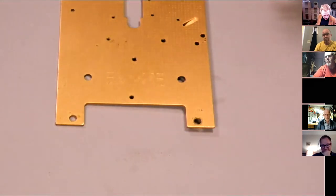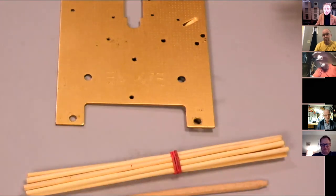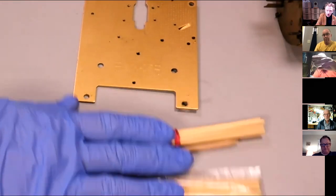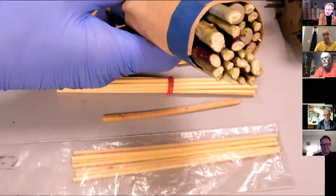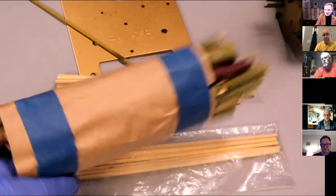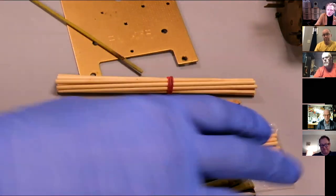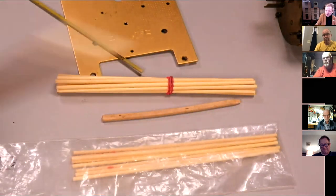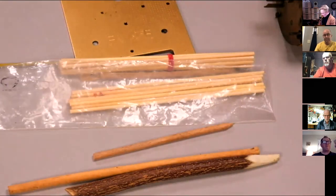But again, if we go back to the pegwood tray thing, you can buy commercially pegwood like that. Some people use bamboo skewers. I'm not against those. I don't particularly like the way that it works, but if you've got a garden, you can get this stuff, which is dogwood, which we got from, well, not from our garden, stole it from somebody else's garden, of course. And this is the stuff that's either bright yellow or bright red stems, dogwood cornus, I think they call it. Dry that out. What else have we got in here? The beech, which are skewers for meat, and so on. But anyway, basically you get the message. You want a bit of wood that you can jam in the hole, and that cleans the hole out.